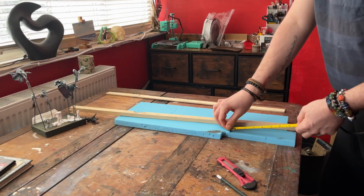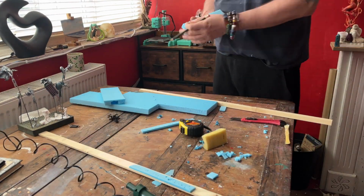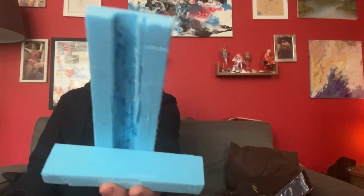And so I tried making a frame for the head to fit in. Out of XPS foam, I made this, which basically fits into the printer. I tried printing with it, and I'm not sure, it's not ideal, it's a bit rough. He printed one on a big printer, and it was all smooth and fancy, but the idea was that the head goes in there and it moves up and down, and it doesn't make that noise. That's my bodged engineering at making that, but that's the idea, because the head wobbles quite a lot. He also said on the video to tighten up all the belts.